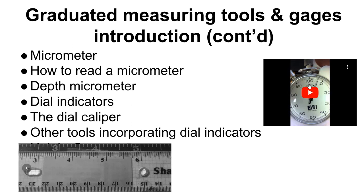Similarly, a tape measure may look like inches but be graduated in decimal parts of a foot. The numbers won't quite line up with a regular inch ruler. Take some time and make sure you know what you're looking at before you record a number.